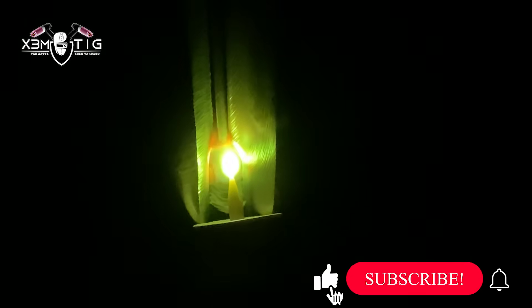No offense to anyone — Chinese manufacturers make good stuff as well. It's all about money; you get what you pay for. For the top section where there's a high-low, I go down about 10 amps, running 100 amps. I just keep that rod lined in the middle and melt both sides — I can see both edges are opening and being covered with filler material.